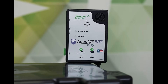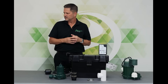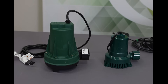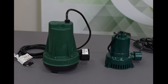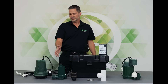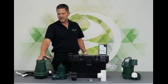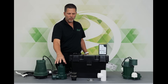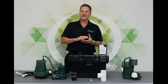We'll compare some of these features with the other systems. The pump itself compares to our 508 pump. The 508 pump is what comes with our Aquanaut Spin and our Aquanaut Fit systems. You can tell there's a size difference. The main difference is that this is going to do about 12 gallons a minute at 10 feet, while the 508 is going to do more like 34 gallons a minute — more like primary sump pump performance. This system would be more appropriate for somebody with a quieter or less active sump pit.